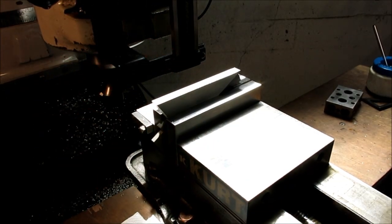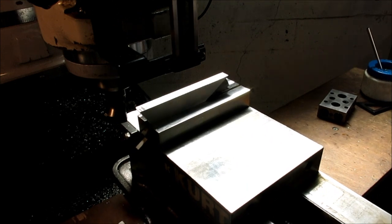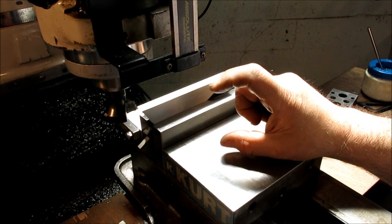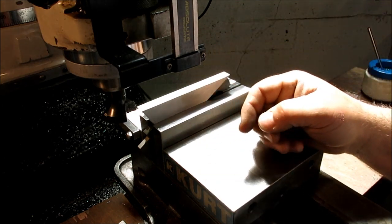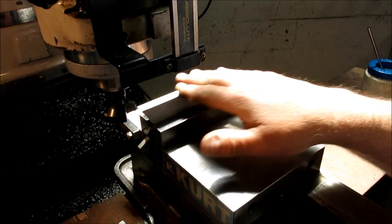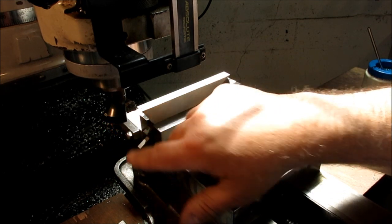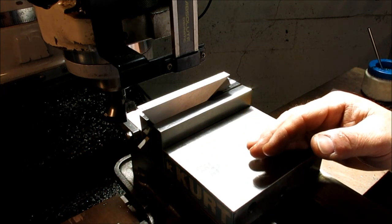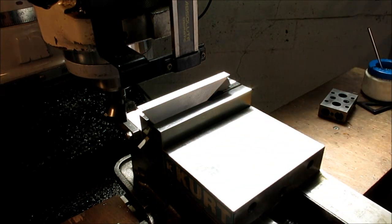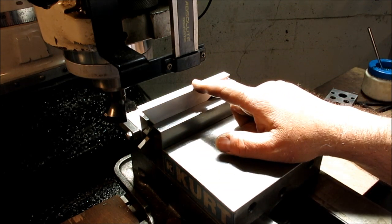So we're ready here. I need to put a little block under the back here to kind of shift this up a little bit so I can cut all the way across without cutting my sine bar. Now, some people might be wondering why don't I just use an end mill and cut 90 degrees. Well, the problem with end mills is that cutting on the side of them causes tool deflection. Working with the end surface of a tool gives you the flattest surface. We want to try to use the same surface on all of those. You can do an accurate 90 degree, but this is the way I'm doing it. If you want to do it with the side of an end mill, you can — the trick is to verify your results.